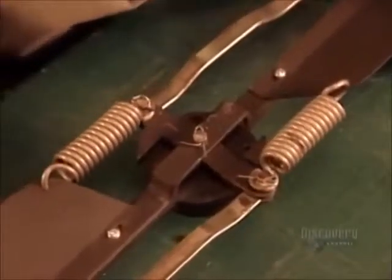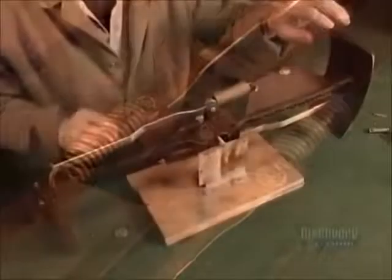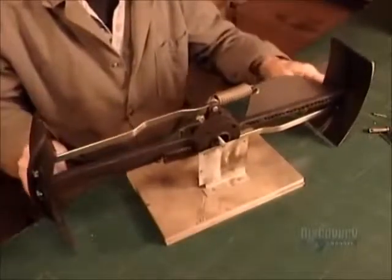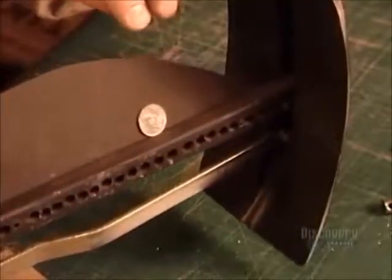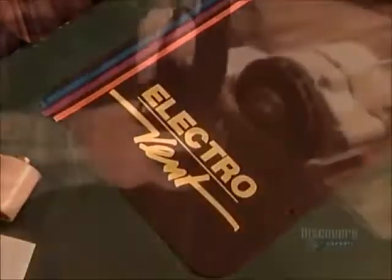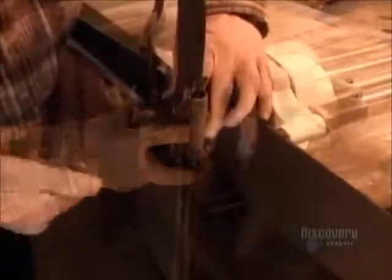This activates the braking flaps, generating drag to slow the propeller down. Again, precision balancing is critical, otherwise you'll have a damaging vibration. After applying the manufacturer's decal, they mount the propeller's rudder onto the back end of the wind generator's frame. On the other end goes the alternator, followed by the propeller and propeller governor, both painted black to protect the waterproof coating underneath from the sun's damaging UV rays.